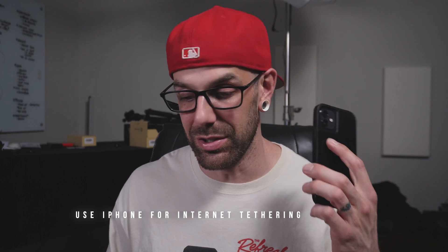Number three — this is a big one you may not know, and you might not ever need this, but say you're taking your ATEM out and you're doing an event — you're the AV guy for the event — but this event is in a park. A park doesn't have wifi, they don't have an ethernet connection or any of that stuff. What you can do is actually take your iPhone and use it as your internet source. You can tether your ATEM to your iPhone. Let me show you how to do it real quick.